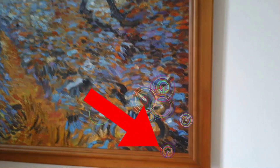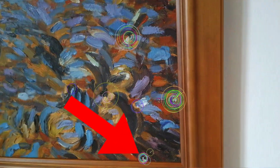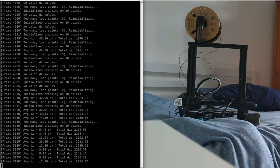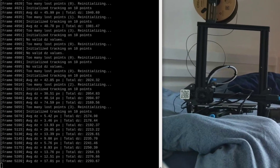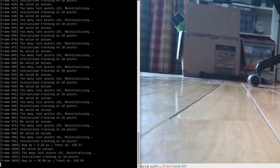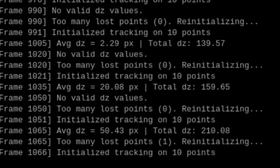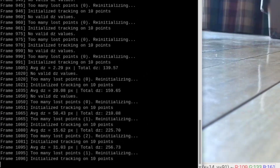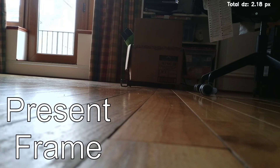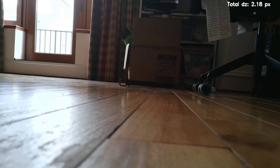Notice how when the camera moves, the frame that it represents changes gradually over time — disappearing at the edges, and objects in the center of the frame gradually get bigger. What if we track those objects in the middle? I've used some feature tracking Python code to find a feature like this edge. As we move the camera and hence our frame, the scene distorts, changing where this feature is in the frame. This frame is made of pixels, and as the camera moves and that distortion occurs, the feature's location in the frame actually changes. We can measure how much it changes, say every half a second, with a change of pixels in the X direction and the Y direction.